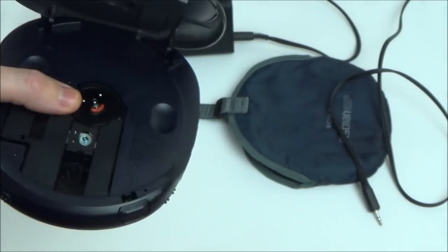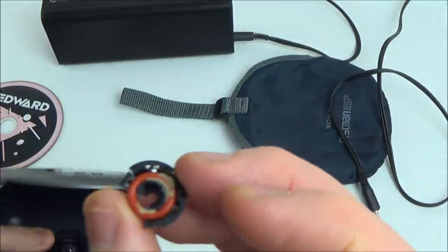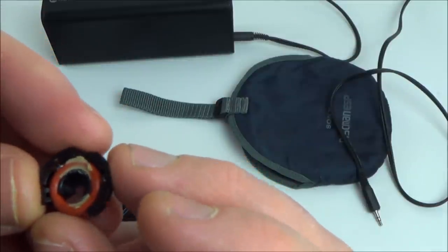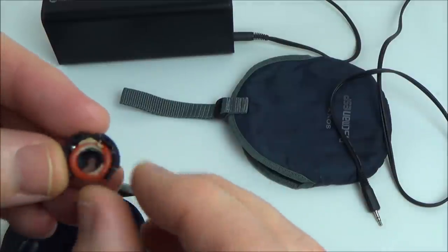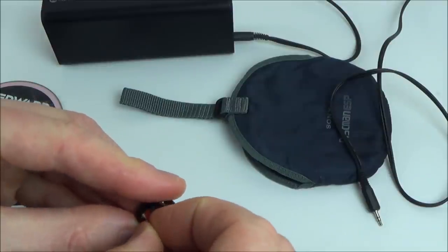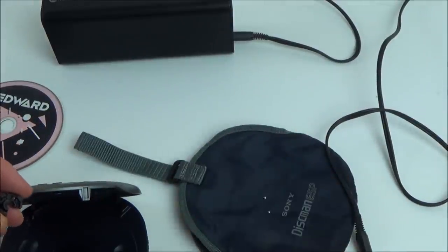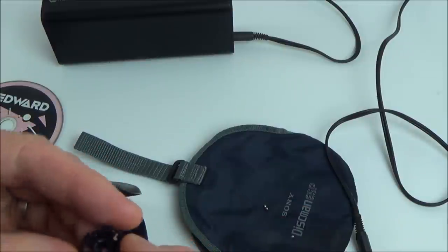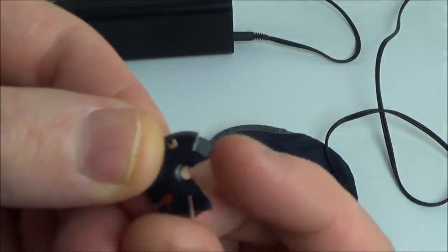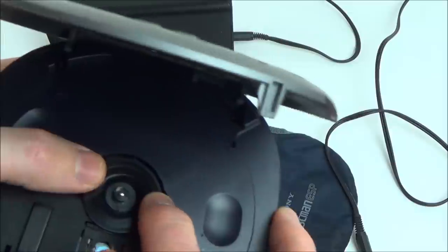Actually it's cracked all the way up — it's actually off. There's a little ball bearing there. Yes — the whole thing comes off. It's using a rubber O-ring to push the ball bearings out. If I take out that rubber O-ring I should be able to glue this back together. Let me take the ball bearings out so I don't lose them, put them in a bag, and then I should be able to glue this together and crush it back like it was.